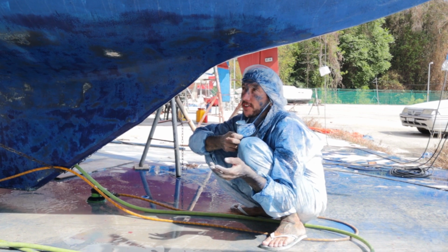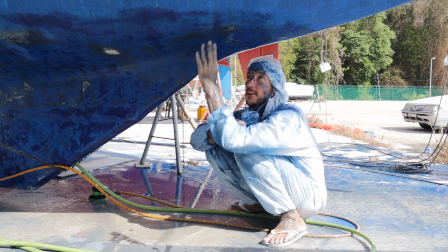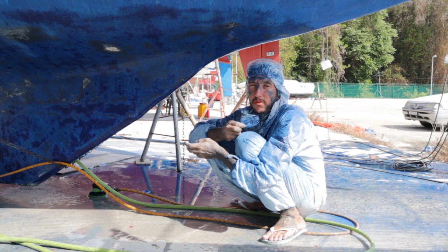Getting there. Really happy we did such a good job on this the last couple of times that we've anti-fouled, because I'm basically just taking off the barnies. You don't need to go over much of it. We got a very similar, different sort of brand anti-foul, but the same sort of stuff. So we should be able to just coat that on here, and just a few patches we'll have to put primer on. The old anti-foul was a Hempel slow releasing one, and it worked really well.